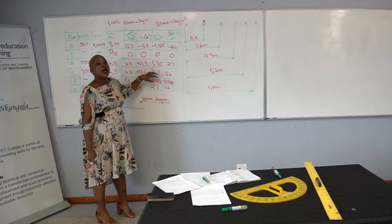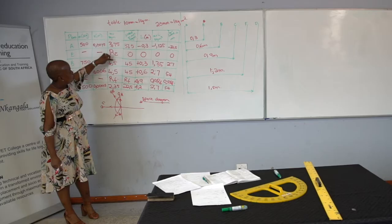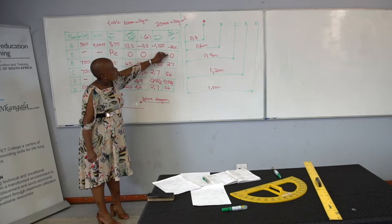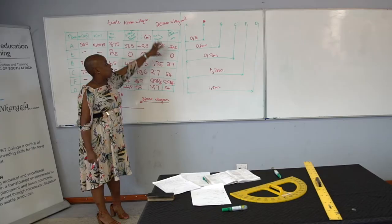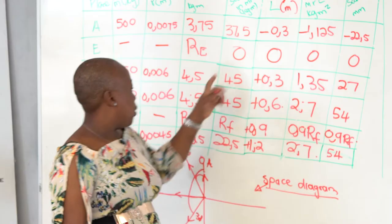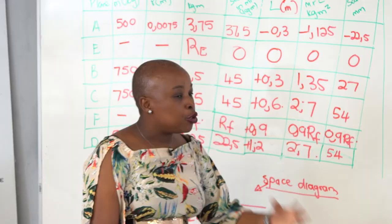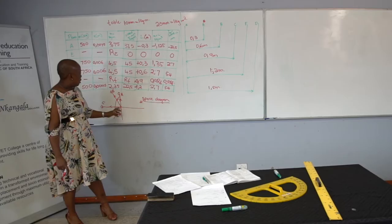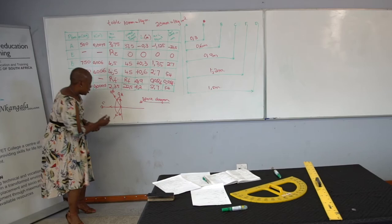When I look at this, I've got one, two, three, four, but I've got two unknowns. For now, this won't work for me. I come here, I've got one, and this already is zero. I've got two, three, four, and one unknown. We can work with this one and try to find at least RF. When we are done, we can replace here and find RE in magnitude in Newton. Then how do we draw? We are given the direction from the space diagram. They are saying A is at zero, B is 30 degrees to A, C is 90 degrees to A, and D is 150 degrees to A.